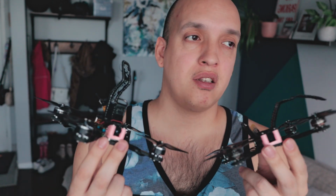You can fly these with a 900 mAh battery and a naked GoPro and stay under the 250 gram limit. So I think that the future of drones is going to be sub 250. When flying these, with the performance that you get and the joy that you get out of flying, I don't feel like I'm missing anything. I absolutely love them. And I didn't design these to make money. I didn't design them to just throw electronics in them. I designed them specifically for me and what I want, but I thought about as many different possibilities as I could for you as well.